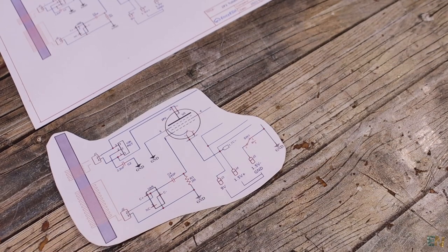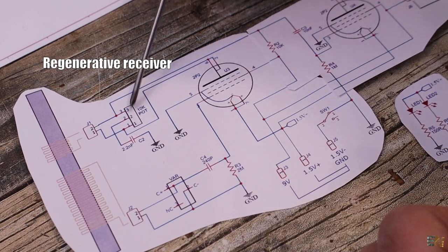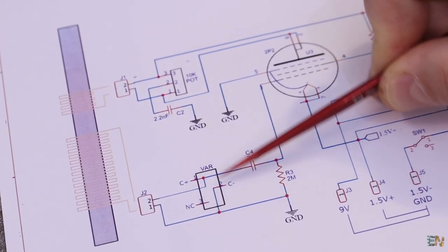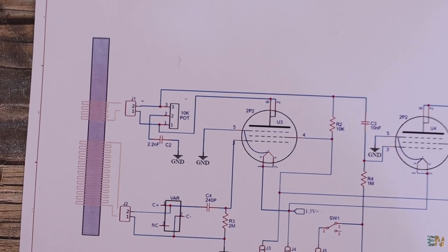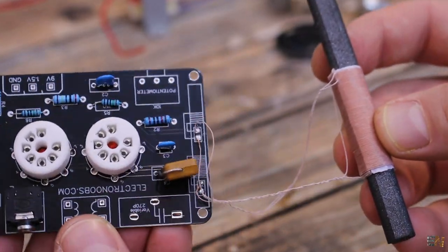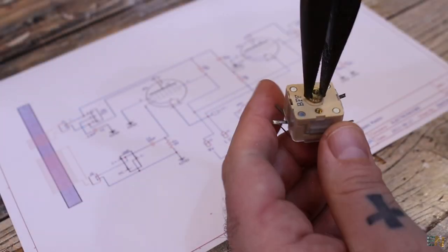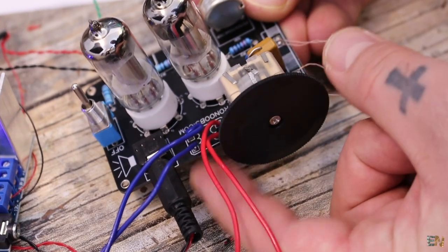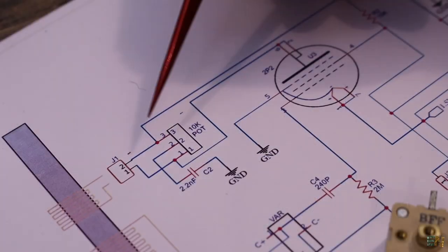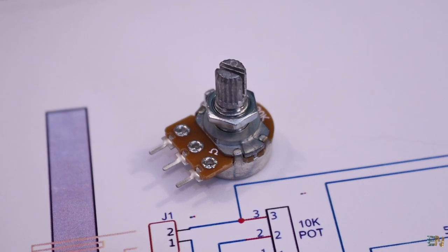We can divide this circuit into two main parts. The first is the so-called regenerative receiver. It's made out of some coils, a potentiometer, and capacitors, and is connected to the input of the first vacuum tube. This entire part oscillates and resonates at a specific frequency. Connected to these coils we have a variable capacitor — by changing the capacitance we change the resonating point, which is how we tune into other channels of the AM spectrum. There's also a potentiometer used to further tune into different frequencies.